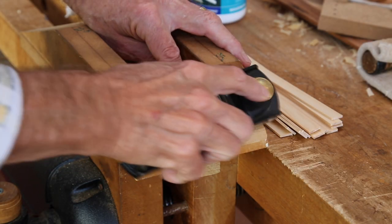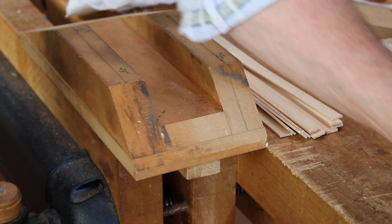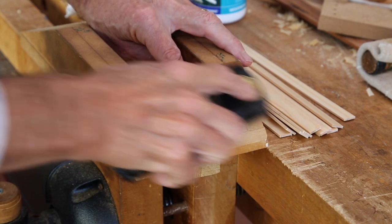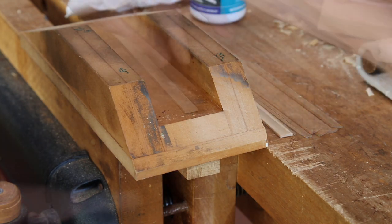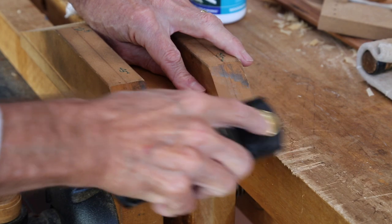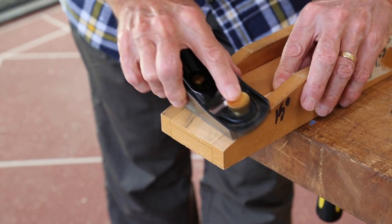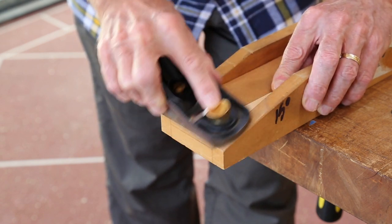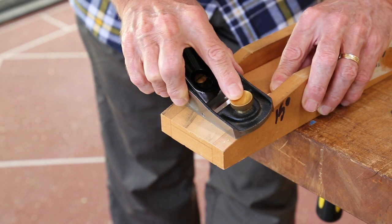The first step is to trim one end on the 45 and 15 degree jigs. Each complete pattern consists of 12 pattern pieces, so it's advisable to work in sets of 12. I start with the 45 degree jig and trim down to at least halfway, then onto the 15 degree jig. Carefully trim the other side so that the point between the 45 and 15 degree angles is in the centre of the kumiko piece.